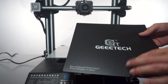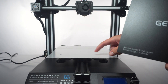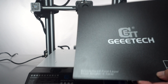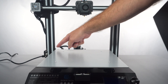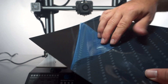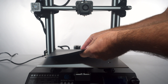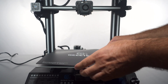Since we're back here you can see how I zip-tied all the cables — they run up and down with no issues, everything reaches, and it definitely looks much cleaner. Let's go ahead and plug in our power cord. For the last part, we need to put this BuildTak-style material on top of the aluminum — it is a sticker. I'm going to take my time: start peeling from the corner, make sure there's no dust or oil, and line it up carefully.